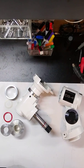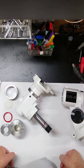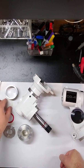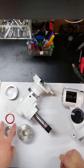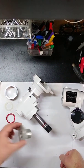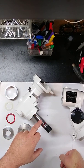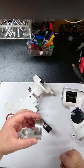I'm going to skip some steps quickly because you don't want to watch me put grease on all these individual parts — that takes a lot of time. So here are the parts: the last two fiber washers, a large one and a smaller thinner one, the plastic washer, our large ring nut, the right ascension worm wheel, right ascension axis, declination housing, right ascension housing, and the right ascension setting circle.